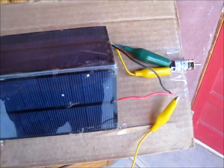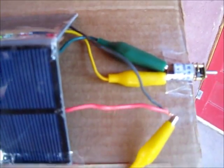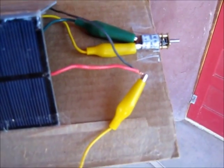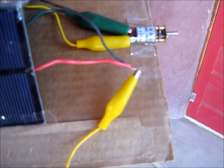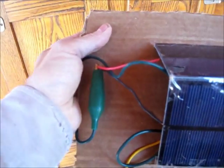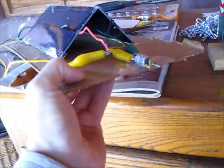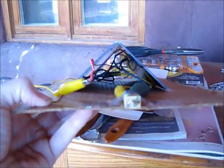I have them connected so the positive of one goes to the negative lead of the other panel, and over here likewise I have the positive and negative tied together. Then all you do is simply connect the yellow wire — I have a yellow alligator clip going to one lead of the motor, and the green lead comes up over here. That is all there is — no transistors, no integrated circuits, capacitors, resistors, or anything.